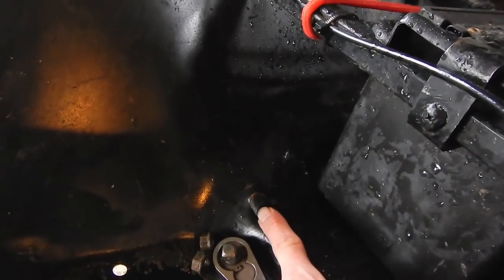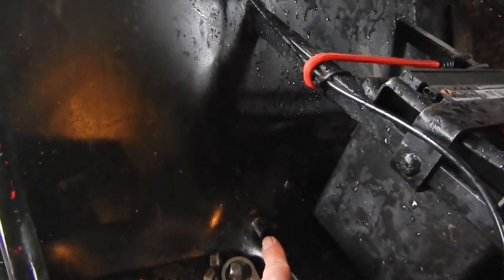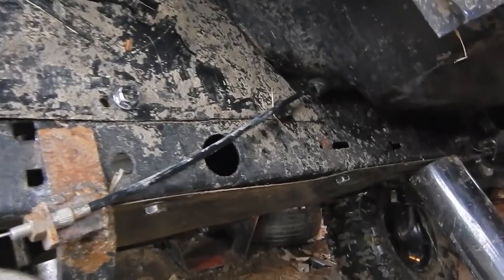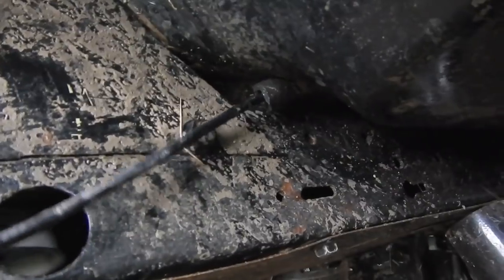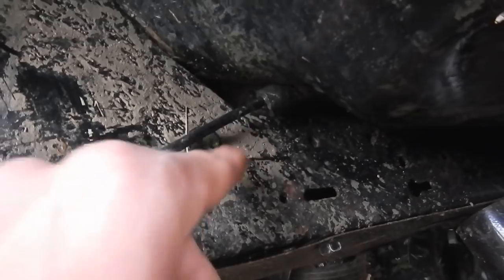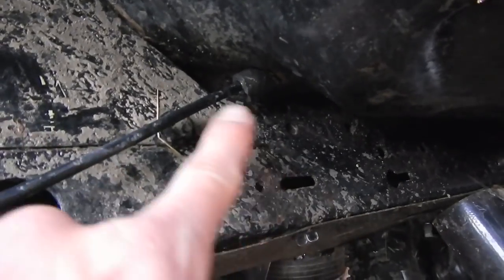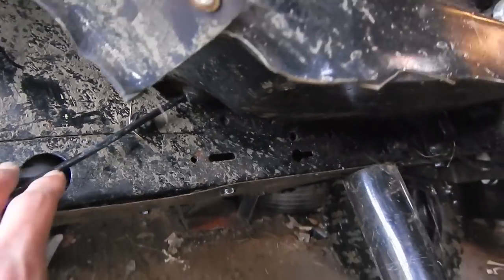What I had to do here was drill a big hole through my rear fender. I put a piece of rubber hose into that hole and then ran my plastic conduit through the center of the rubber hose. The reason I did the rubber hose is because the conduit is coming through sharp pieces of metal, so I don't want it to get chafed. There's a lot of vibration driving off-road, so just slide a small one-inch piece of rubber hose in there and run your wire through it so you don't ruin things.